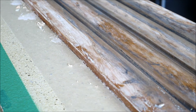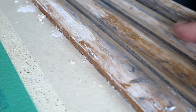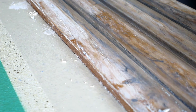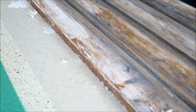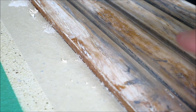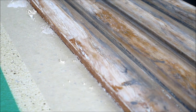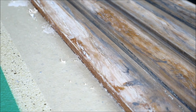The side is actually getting worse instead of better just because I'm hitting it with so many chemicals right now. You can see the wood looks kind of bleached out, but I'm not worried about that. What I've been focusing on are these lines — these grooves in the wood that had black in them. I could not get it out with the Citrus Strip. I've had some luck with a 50/50 mix of denatured alcohol and lacquer thinner; that really seemed to help. I'll hit this a couple of times with a green Scotch-Brite pad, then follow up with paper towels to get the residue out — work it in, scrub it, then remove with paper towels. I'll hit it a couple more times, then try sanding to see if I can get it back to looking like real wood.